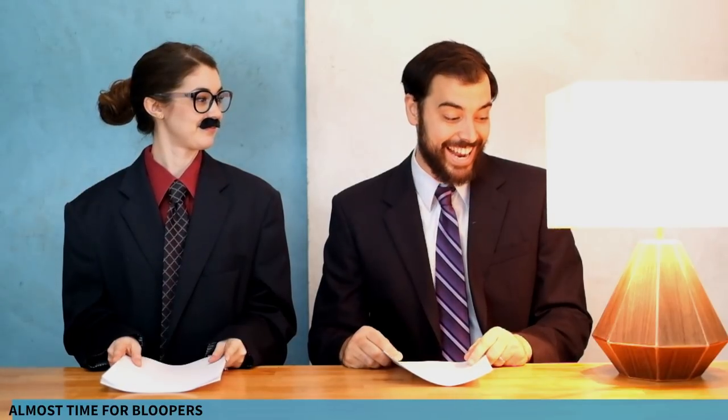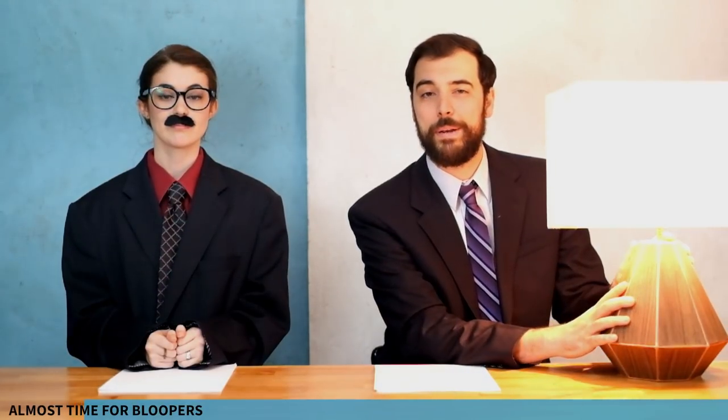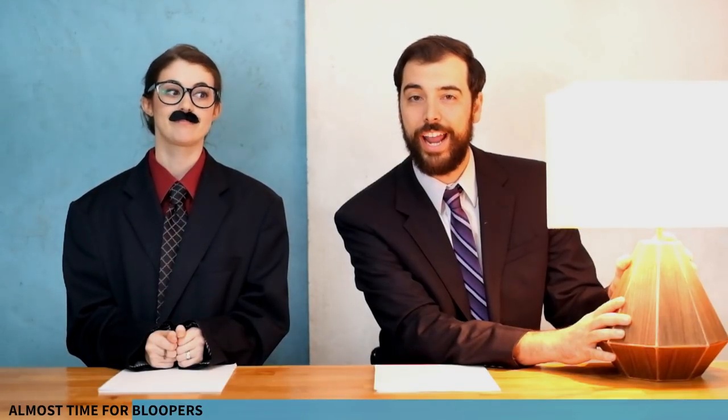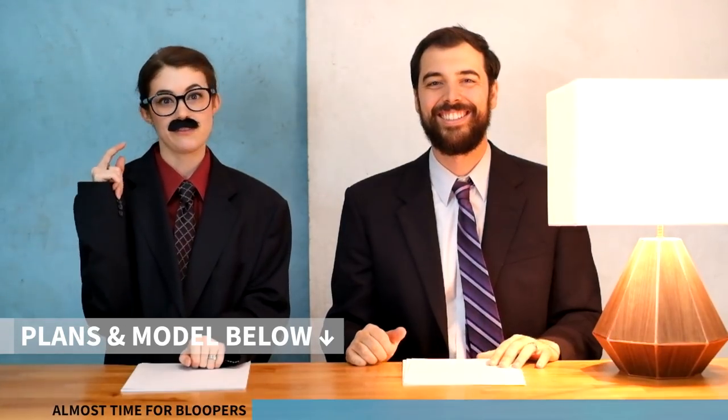Well, it is done. The main difficult part was clamping it all together. All we'll do differently is clamp it in place with painter's tape and oil it afterwards. Putting the oil on beforehand made it really hard to cinch it all down. We have a link to plans, the model, and the templates to cut out the panels below. And all the lessons we learned the hard way we're fixing in the model.